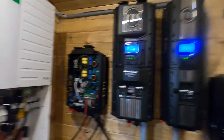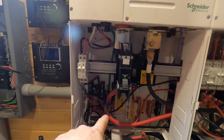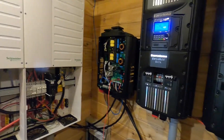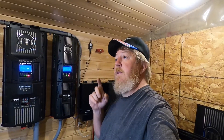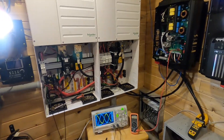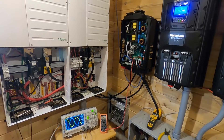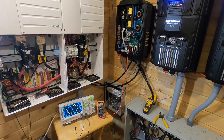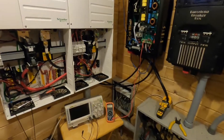We're all set up. Inside we've jumped the utility to the backup power so everything is fed from the Rosie. We've gone up to our electrical pole and pulled the main breaker — so we're back-feeding all the way to the main breaker, but it's off. We have Sue on speakerphone; she's in there with the air compressor. Sue is going to flip the breaker when I tell her to and we're going to see what happens — we're ready to kill everything out here too if something goes horribly wrong. Go ahead Sue, flip the breaker. As you guys can see, it did not work — the inverter went into some really weird oscillation and then actually shut down.